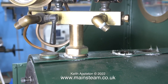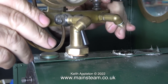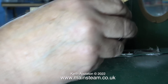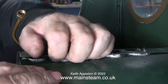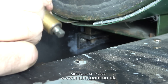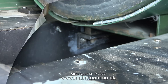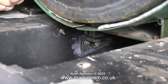With both safety valves out of the way I can simply rotate the turret to remove it from the bush in the boiler. All major inlets to this boiler are fitted with proper bushes — the only ones that weren't were those for the water gauges. The firebox cladding is in two halves so it should come away quite easily, especially after unscrewing the blow-down valve underneath. I slowed down this clip to show that when I shook the blow-down valve, not much rust came out — and I was really hoping water wouldn't come out either.